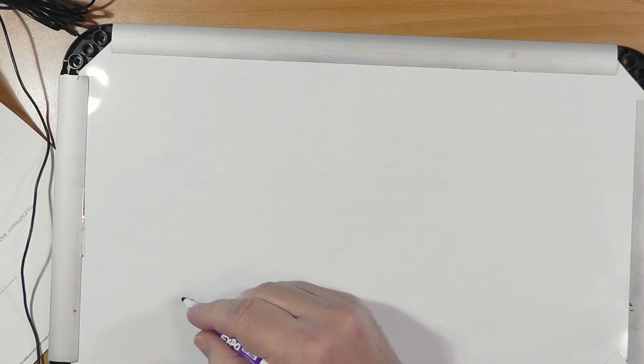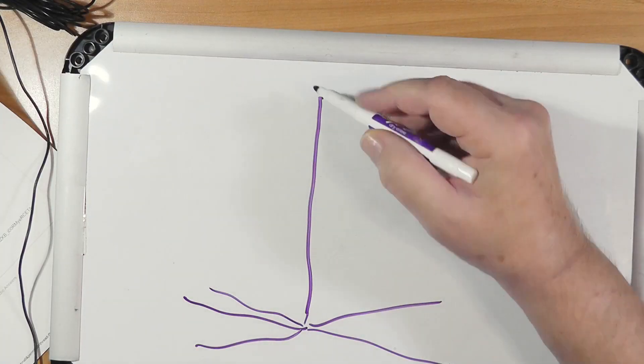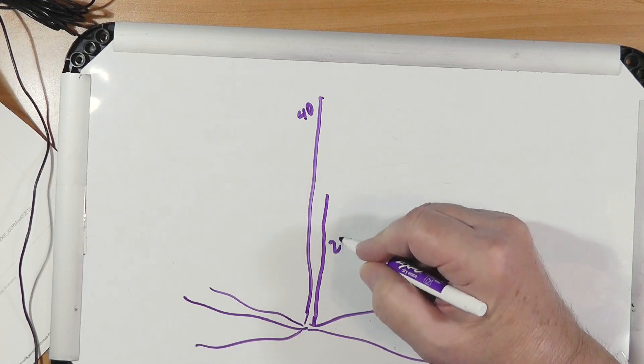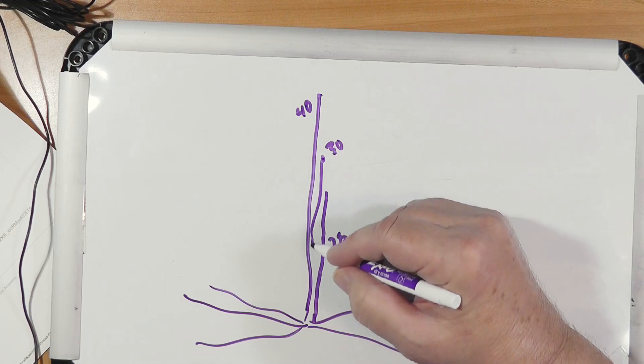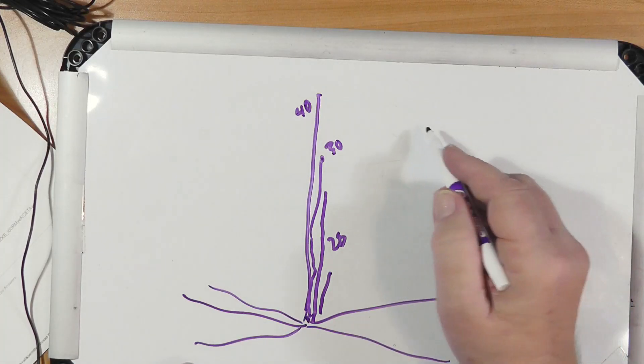It's plastic, and the reason it's plastic is because what the DX Commander antenna is — I'll just draw a picture of it right here. You've got some ground radials down here, and then you have a fan vertical. You have a wire for 40, a wire that's half as high for 20, you've got one in the middle here for 30, and these are all connected down at the bottom. Then 10 and 15 and all of those other things like that.